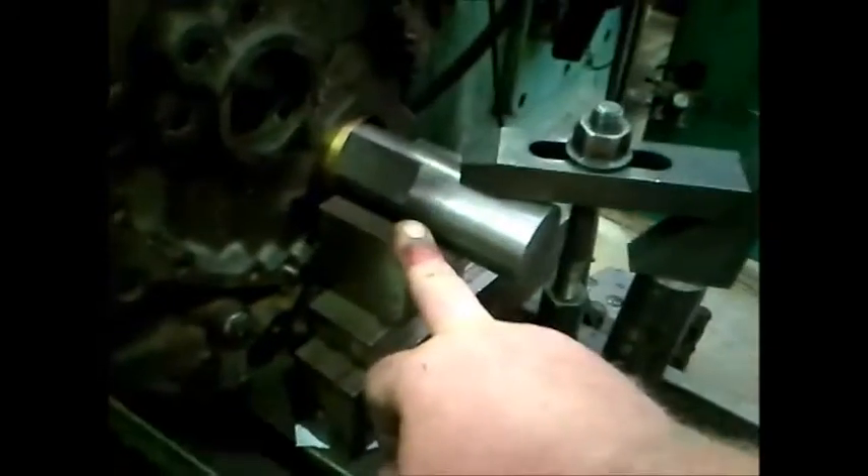These machines are built incredibly square, so you can trust — I mean you check it of course — but you can trust that the machine is square. When we set up a V8 block particularly, we start with machined parallel blocks and then end up with machined V blocks. All these blocks are machined as pairs so they're all exactly the same height. By setting them up like that at both ends, you end up with your V blocks being square with the bed of your mill. We then put a bar in the block and it's clamped into the main tunnel. So the V blocks are square with the mill, the bar's square with the mill, therefore your main tunnel's square with the mill.